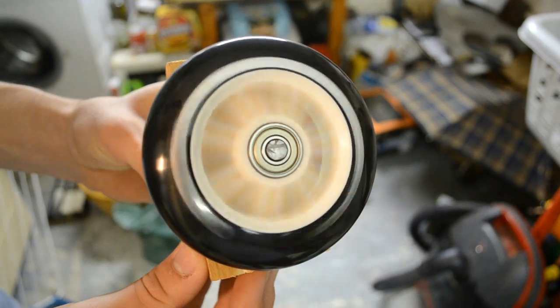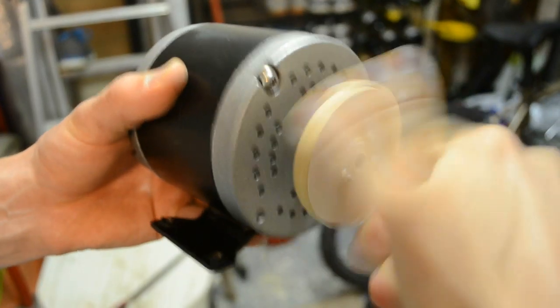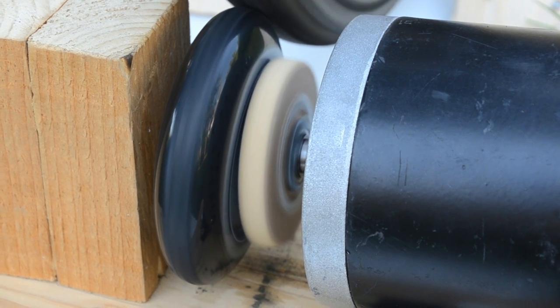We use a scooter wheel held to a wooden mount. The torque — that means the rotational force — is transferred with screws to the motor's sprocket. By adjusting wisely the pressure between the bike and the scooter's wheels, it's possible to communicate power with a reasonable efficiency.